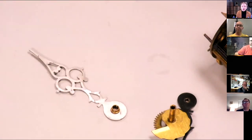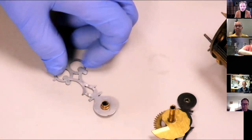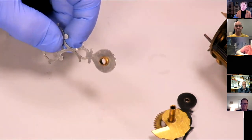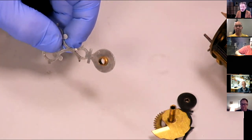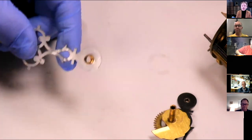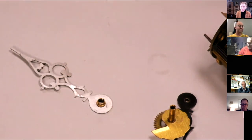And I found the best way with this, and this isn't going to be particularly helpful, I'm afraid, but if you've got a collet lathe, and watch people, you have to put fingers in your ears. Basically, if you've got something like a bigger collet lathe, like a watchmaker's lathe, but bigger, find a well-fitting collet and actually just very gently squeeze this hand collet smaller. That's the most successful way that I've ever found of doing it. But obviously we don't have that option.